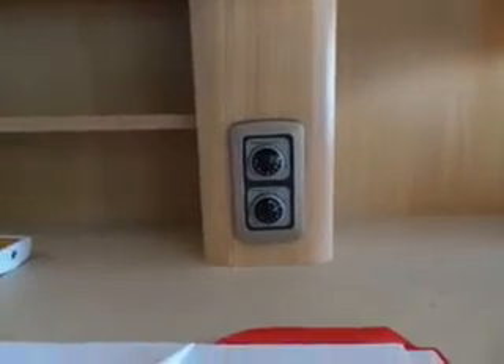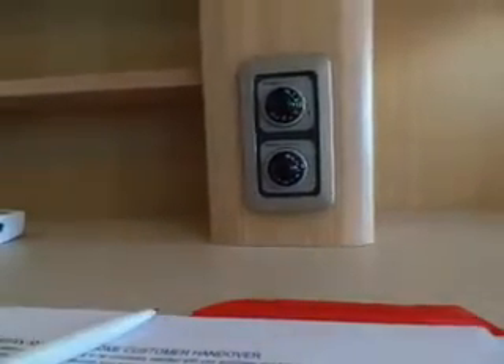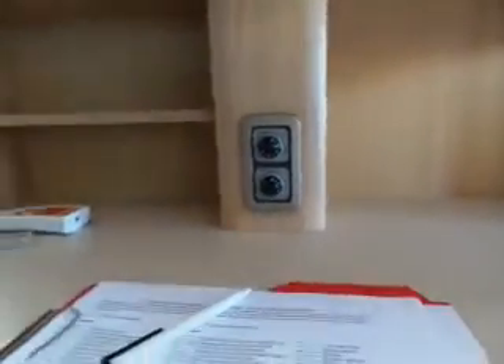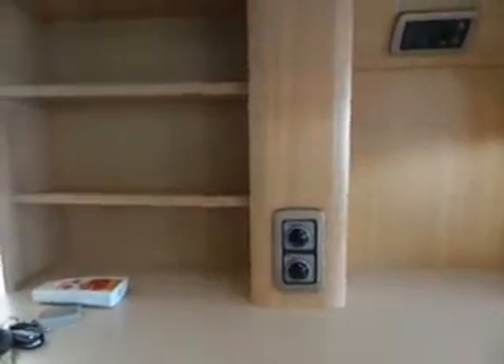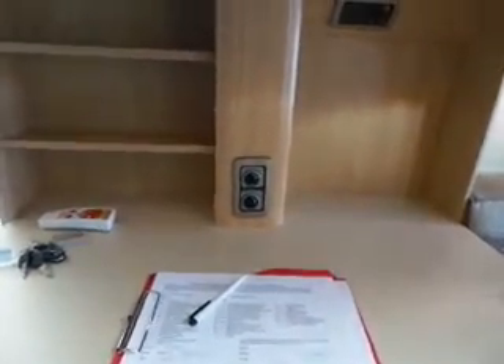The difference between heating on gas and electric: on the gas side you have more control — electric is just thermostatic control to 70, whereas with gas you can vary it. You can operate on both if you want. If you want to heat the water quicker you can do both at the same time.